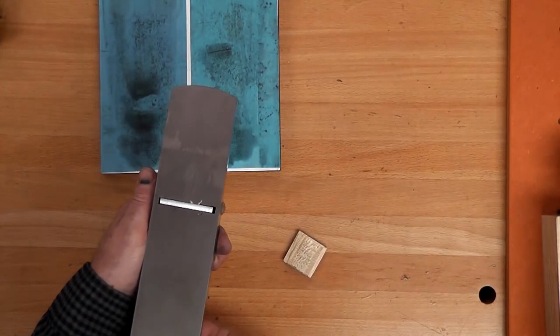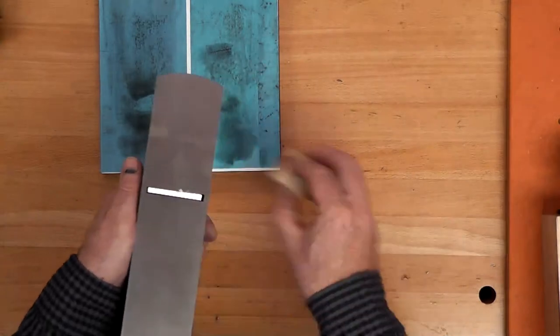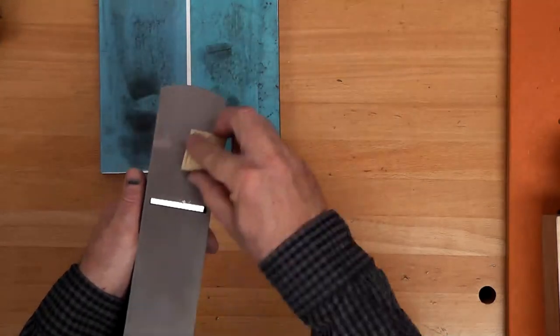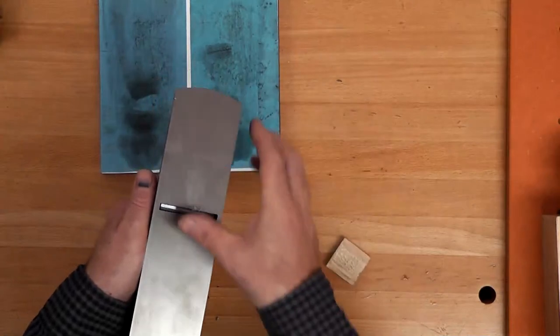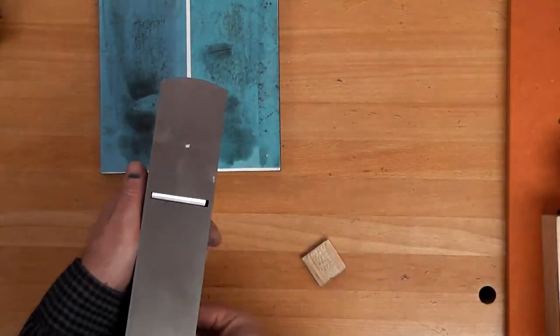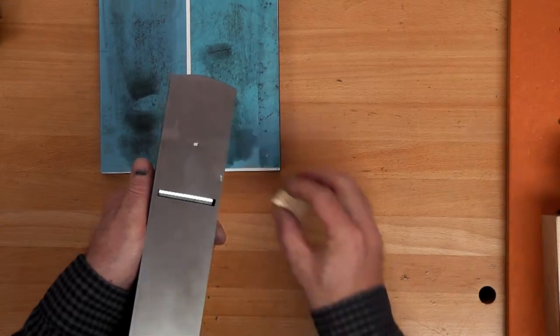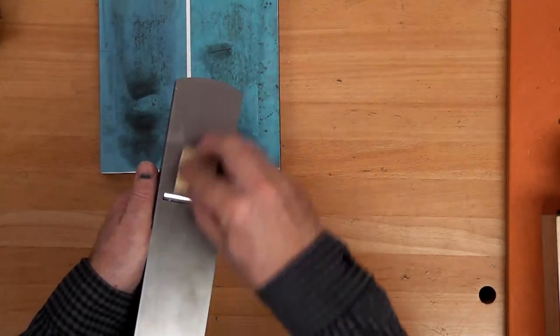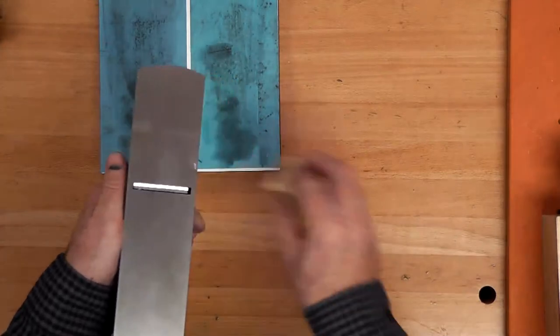Hitting it really hard. Now, still cutting one side more than the other. Come around, move your lever. That's better. Got a fluff shaving that's caught in under there. Let's move that carefully. Got to wind it forward a bit. Now, before you go into your job, this is allowing you to set it up to get that nice cut and figure out where things are cutting.